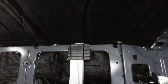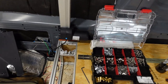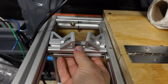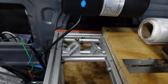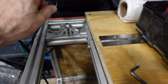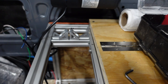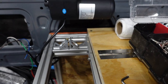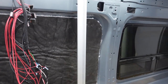Working on the rear actuator mounts — same approach at the top with plus nuts. At the bottom, I made a similar mount that I can slide forward and back to adjust. This lets me then fine-tune it front to back. Now we're going to line it up and get it perfectly aligned with the other ones. That's one more done — and now we have all four posts in for the bed lift.